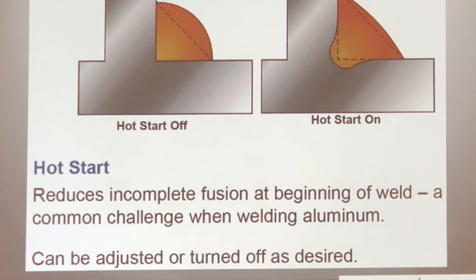This seminar was geared toward aluminum MIG and pulse MIG, but it also holds true for TIG and stick welding. It has to do with aluminum being an excellent thermal conductor — essentially sucking the heat right out of your weld joint. To avoid cold starts you need a little higher current and higher settings at the beginning to punch in. You can preheat, and preheat will help. Hot start gives you that extra edge — some machines have it, others don't. If you don't have hot start, you definitely need to preheat.